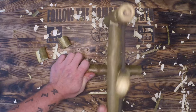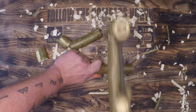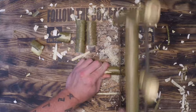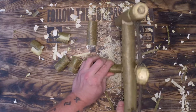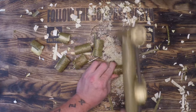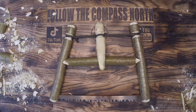On the test cuts I did get some binding, but that's mostly because I'm cutting these six-inch pieces down into inch-and-a-half long pieces. If I was cutting a tree and allowing it to bend over while cutting, it would be no problem whatsoever. I also like that I can cut straight down onto my work surface without scratching it, because the two vertical risers — technically called the handle and the bow — prevent the blade from coming all the way down into the work surface. Overall it works pretty great for being a couple of pieces of wood and some 550 cord.